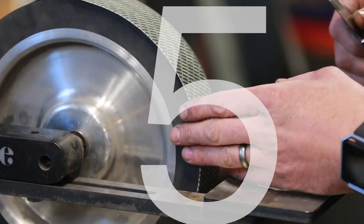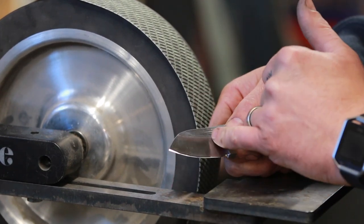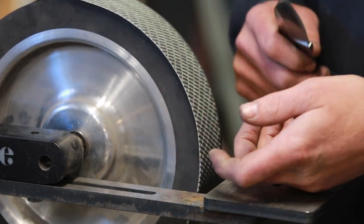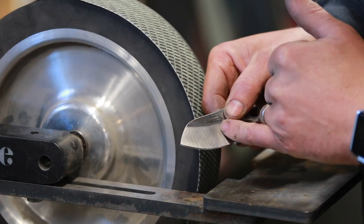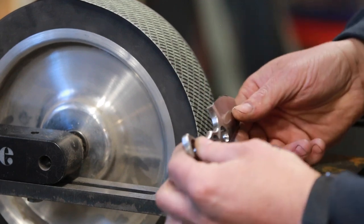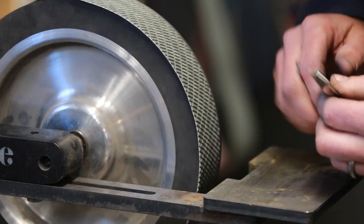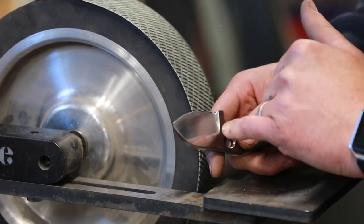The last tip is a finishing tip. When finishing up bevels and wanting a nice sweeping plunge line transition, I'll run my belt intentionally off-centered — off the edge of the wheel or flat platen. Right now I'm about a quarter inch off; sometimes up to three-eighths of an inch depending on how much sweep I want. It really allows you to blend things together — a nice sweep transition from the bevel to the flat part — giving a little forgiveness and cushion. This is a really handy tip for cleaning up one of the more difficult areas.